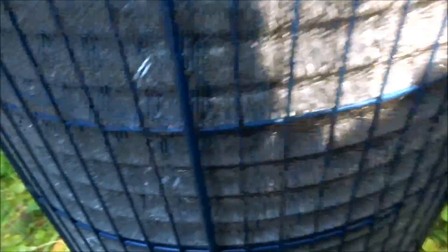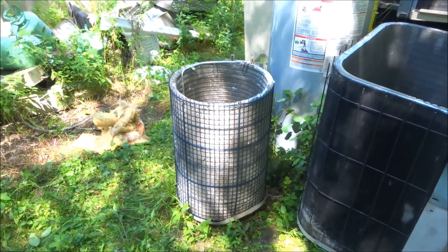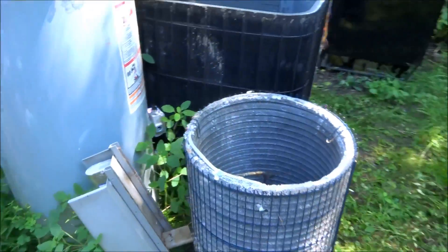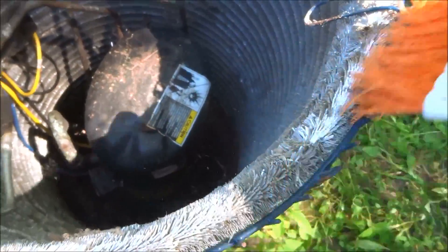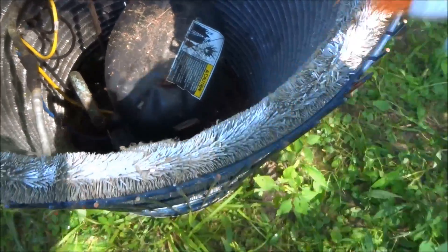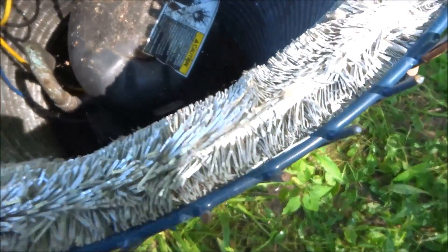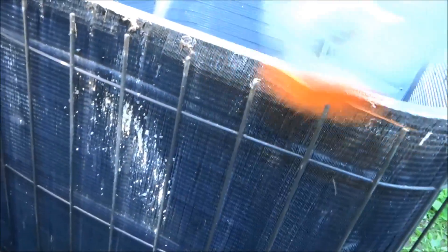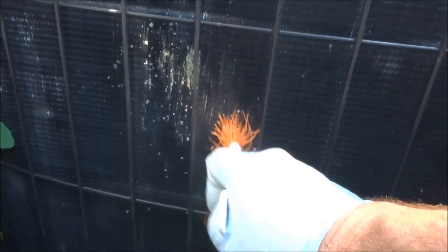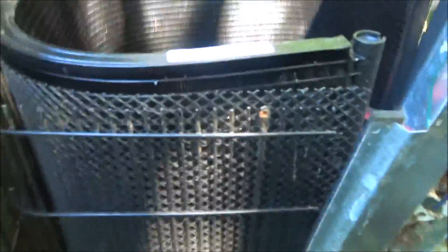A lot of guys don't like the spine fin — that's the old Trane design, and Trane guys swear by them. I've got nothing against Trane, but this is the type of coil they have and I'm not a big fan of cleaning these. What happens a lot of times is these fins will just pop right off. You really can't hit it with a brush hard because you can knock the fins right off. With a copper/aluminum coil you can hit it with the brush no problem and get right in there to get the heavy stuff off.